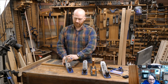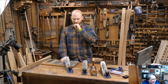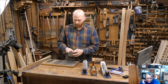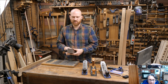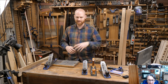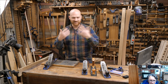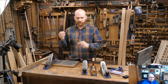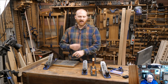The next problem that pretty much every beginner is going to have is the sharpness of the iron. It's very hard for me to describe what is sharp, especially over a video. If you were in my shop I could show you and you could feel and hear the differences — there's just so many things that go by feel. Usually the best way I can describe it is by shaving hair. If you can sharpen an iron and it cuts hairs, then it's starting to get sharp. If it's not cutting hairs, it's dull.